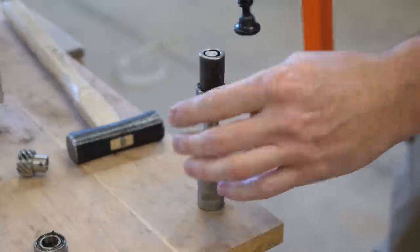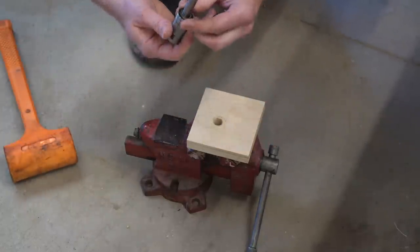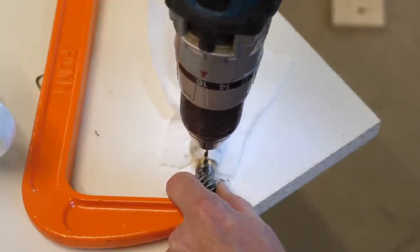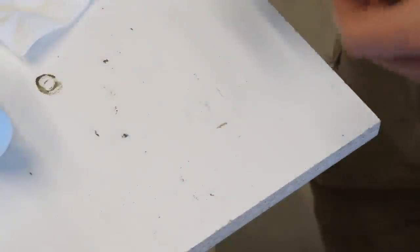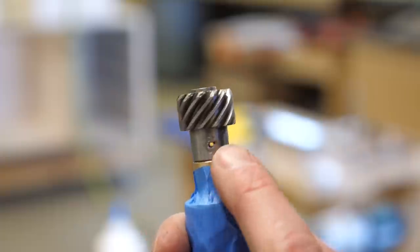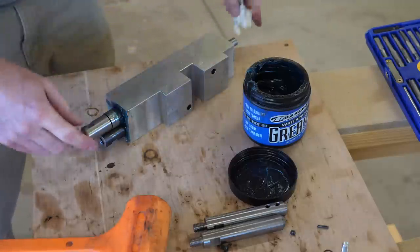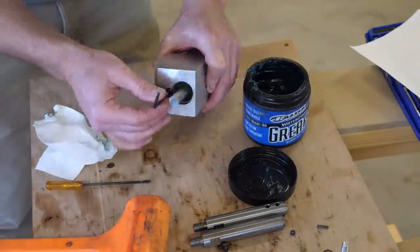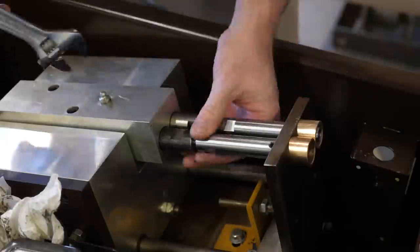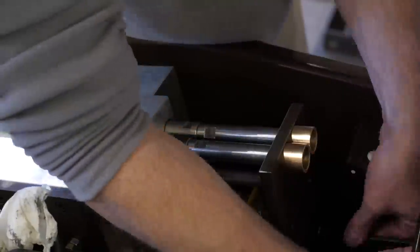I move on to the spindles. The bearings were all in good shape but small and cheap enough, so I chose to install new ones — four per spindle. It's not a good idea to install bearings by tapping; a press is better, but when tapping I make sure the bearing is well supported. The drive gear is held in place with a split pin, and the gear's location holds the spacers and therefore the bearings firmly in place. I drilled a hole of the correct size, installed the split pin, then ground it down. After adding copious amounts of blue raspberry grease, the spindles go in. I install the drill head and align it with the bushing holder — the goal is to minimize drag when spinning or plunging. The best approach was to put everything together loose, wiggle it around, tighten, then check for friction.